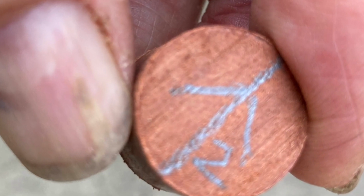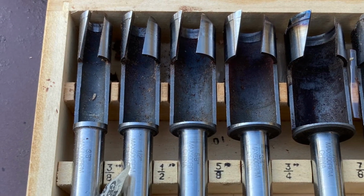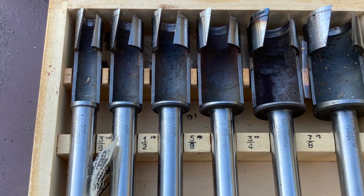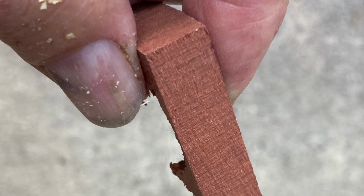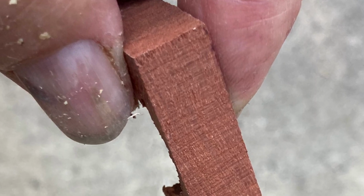Next, you need to get the plugs to put into the holes. In this case, I decided to use a red gum plug. The tools you use to cut the plugs are called plug cutters. I cut them from a thickish piece of timber, in this case maybe 14mm. Thickness is important. Those plugs should extend well down into the stock timber. The plug cutters really only work in a drill press. Anything else and you get a very, very strange shaped plug.